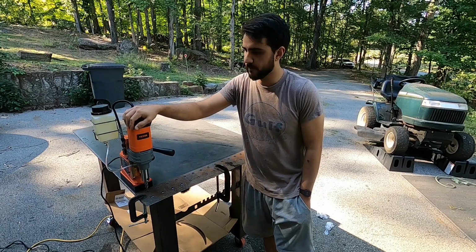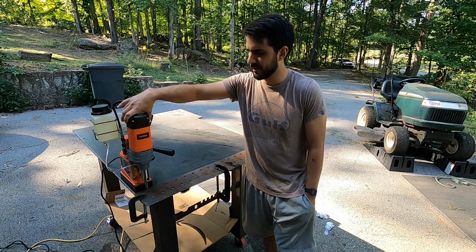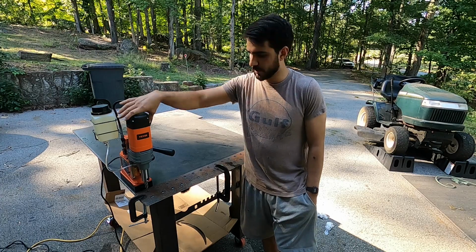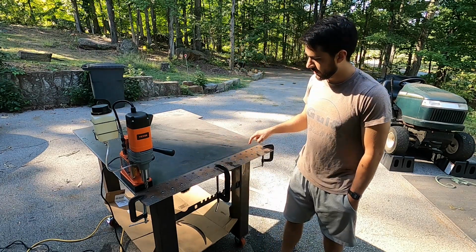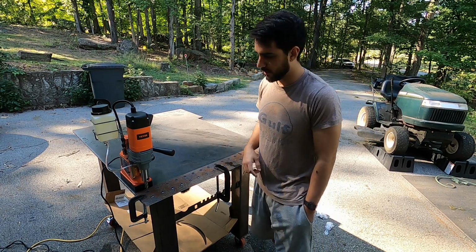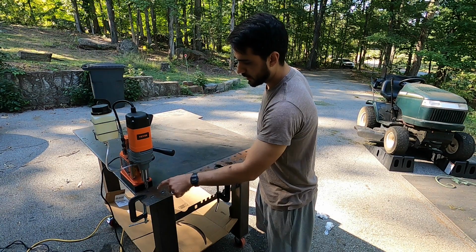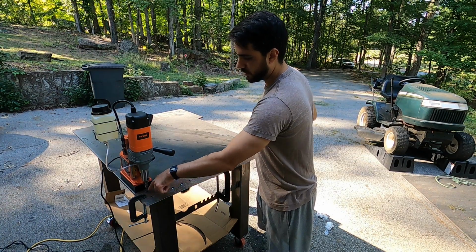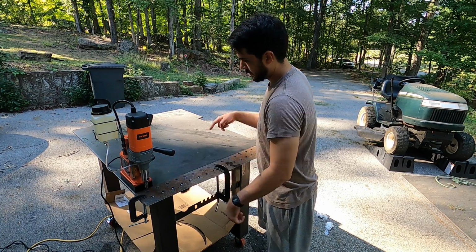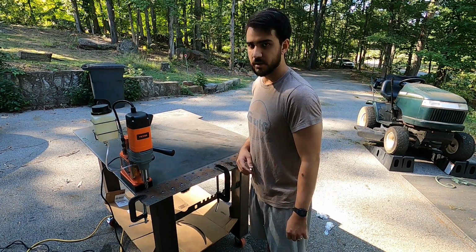Got our Weaver mag drill off of the Weaver online store. This thing was about 250 bucks shipped. Annular cutter off of eBay, it was about $20. And I made a template for my hole pattern on my plasma table. So I'm going to drill holes along here, then I can just take the next hole, pin it, and I'll have my hole pattern to line up the drill every time. So let's see how she do.